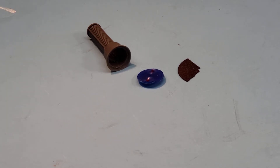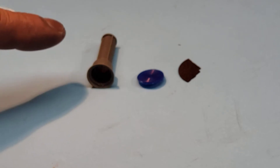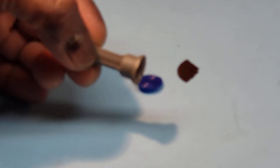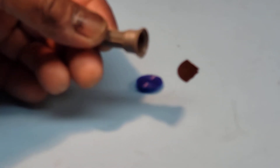There were multiple crash and burns that Sunday, in addition to the ones I just talked about. That one looked like a great piece right there — it's actually a little filter from your water sprinklers, your lawn sprinklers. They all have a little filter built inside. That would have been perfect, just cut it off and put a flat piece on top. However, as I handled the object I noticed the plastic — it's slippery, it's kind of like a Delrin type, what they call engineering plastic. It's done that way so it doesn't dry out. Problem is you'll never get glue to work on it and you'll never get paint to adhere to it. So this is a no-no — that's another crash and burn, another unhappy little tree. Sorry, Bob Ross.